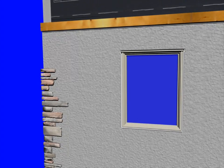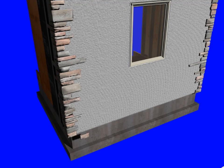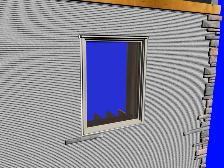Because we have a sealant joint around the window, it'll be helpful to take pieces of stone with a fairly straight edge so you can place those directly adjacent to our sealant joint. The sealant joint needs to be visible and serviceable — we're no longer going to grout from the stone to the window.